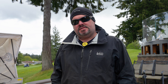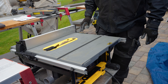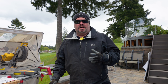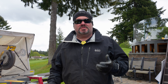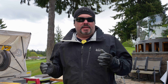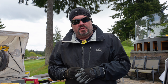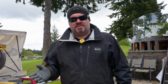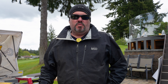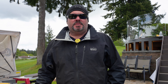What I have here is a standard 10-inch table saw — this is not a cordless version, this one actually plugs in. I prefer a plugged-in version because I need a lot of power when I'm ripping pressure treated materials; it's really wet and really dense. A cordless battery will only last so long, and my depth of cut is less on a cordless saw because you're using a seven-and-a-quarter-inch blade versus a 10-inch blade. Metabo HPT does make one cordless 10-inch saw with a power adapter — we've used that in the past, but it's indisposed at the moment.